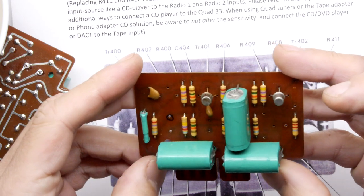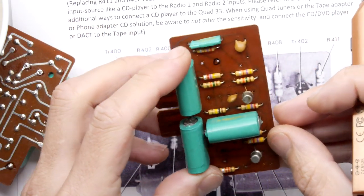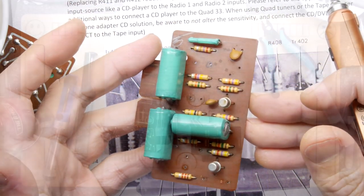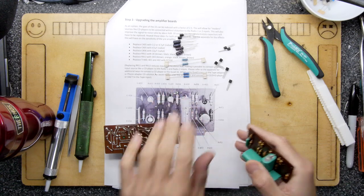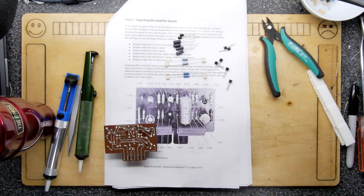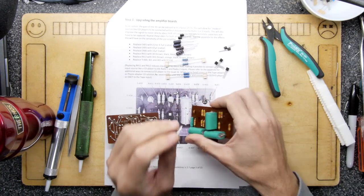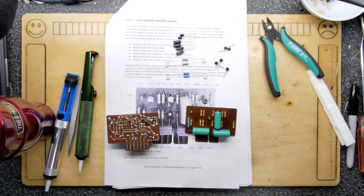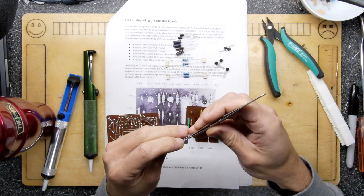Okay, so what I'm going to do is solder suck all this board off the camera, get the parts ready, and we'll just solder them back in like last time. I've done me stuff. Excuse the solder spatter on here. I was cleaning the holes using a hot air blower. It's a little bit of a naughty technique you can use. It does make a bit of a mess, but it is super quick.